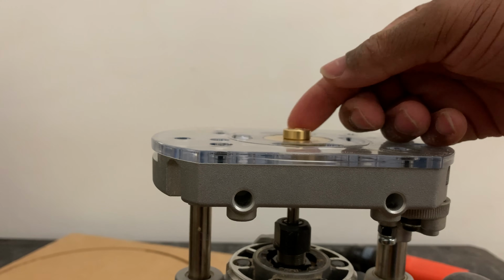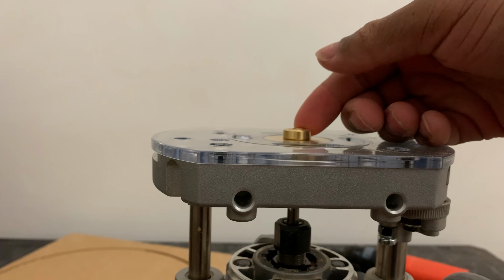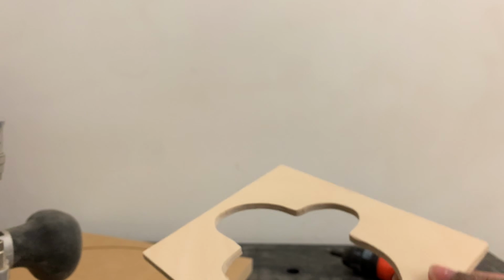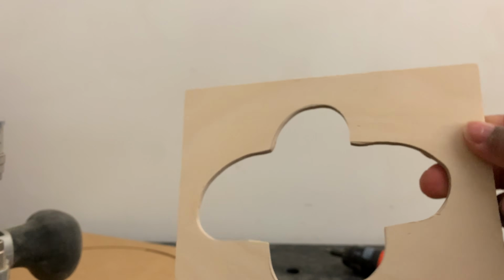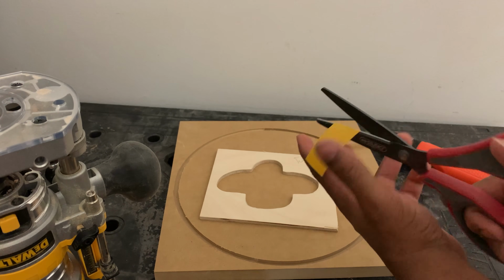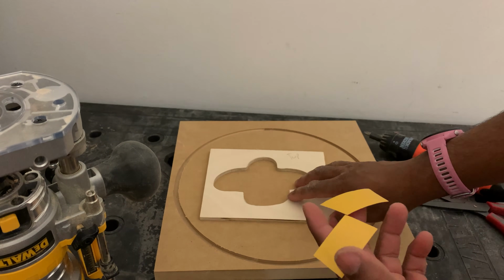So we're going to start off with the wood that's going to receive the inlay, and this needs to have the collar on. And you can use any template that you want. I made this by cutting it out with my jigsaw, but now we're going to cut into the wood that's going to receive the inlay. So you want to secure your template down with double-sided tape. I'll have a link in the description for the exact tape I used for this one.